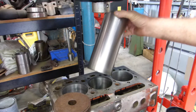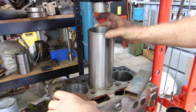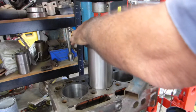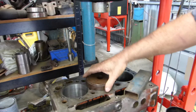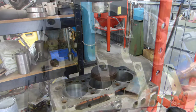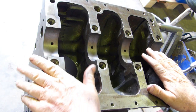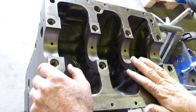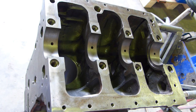We're going to try and drop some liners in. I've got one in. They're not all that tight a fit, which is a good thing. That's nearly too loose but we've Loctited them all in, so that's okay. We've washed the block — took me bloody ages, it was very dirty. We've fitted the liners, so we have them in on the other side there.